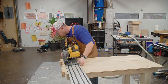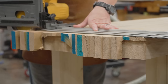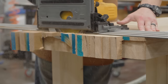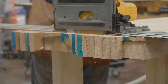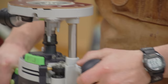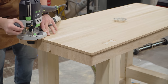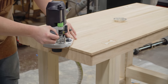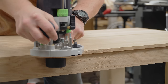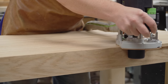With the base cleaned up, I can focus on the top and trim up its perimeter. I cut the perimeter out on the CNC machine when I did all the joinery, to make sure the base joinery aligned perfectly with the top. So I've got a bunch of overhang that I'll use the track saw to cut off first on each end, then use a big flush trim bit in the handheld router. This flush trim bit has material behind each cutting edge which prevents a super aggressive bite — kind of like a depth stop. It's about seven-eighths of an inch diameter and handles the overhang with absolutely no problem.